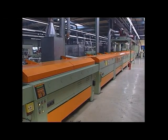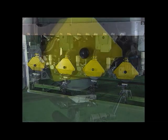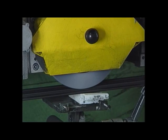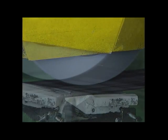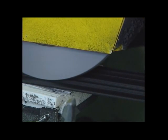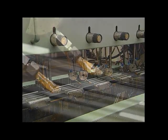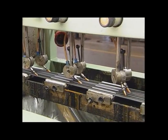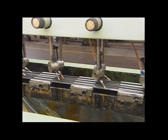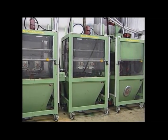The length of the individual machine parts determines the possible production speed. In order to allow for a perfect adhesive bond, the profile has to be pre-treated, whereby the profile surfaces are roughened up by rotating wire brushes. Alternatively, primer, corona, or plasma pre-treatments can be used. The adhesive application is done here with brushes; however, the adhesive may also be applied by spraying with small spray guns. The adhesive coating should only be done on the areas which have to be flocked, so an exact adhesive edge is important.